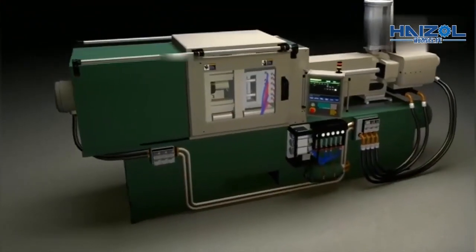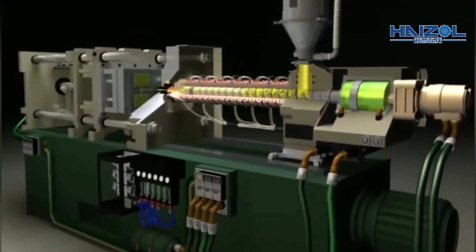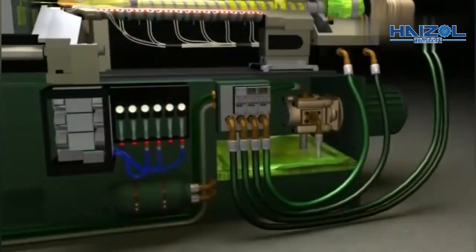The rest of the heat comes from the heater bands around the barrel. Once enough melted plastic is in front of the screw, the ram plunges forward and injects the material into the empty cavity of the mold. About 50% of an injection molding cycle is dedicated to part cooling and solidification, so minimizing the thickness of a design is key to speed up this step and cut costs. The melted plastic enters the mold through the runner system, which contains three main sections: the sprue, the runners, and the gates. The runner system is cut off from the parts after ejection — this is the only material waste in injection molding.